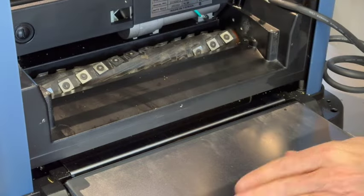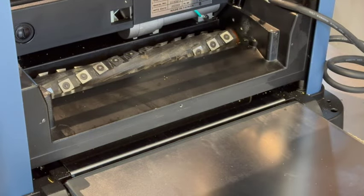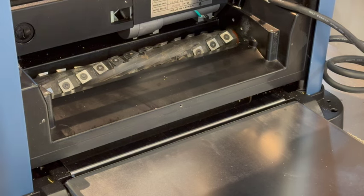These blades come in a slicing motion, very similar to hand planing a board where you skew the plane to create a better slicing action, as opposed to the face of the cutter head impacting the wood straight on. Other planers on the market claim helical heads, but what they really are is a series of straight-across segmented cutters that all engage the wood flat on, not in a slicing motion — a major difference.